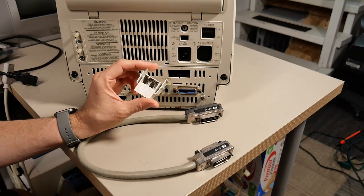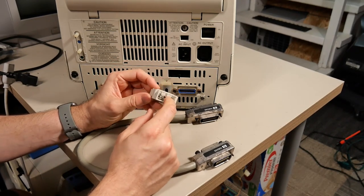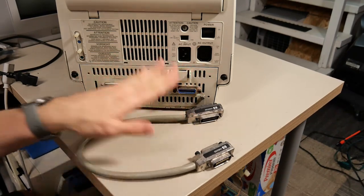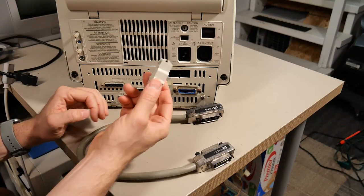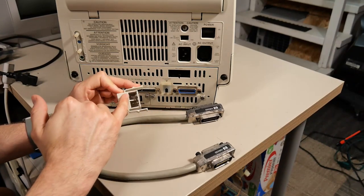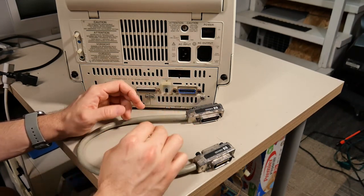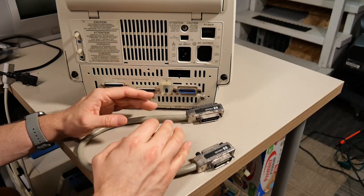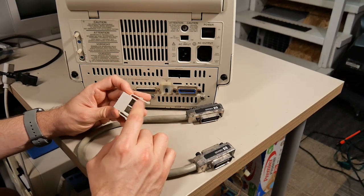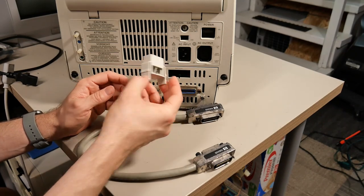This opening on the disk drive is actually for the CMOS battery holder — it takes two 1.5-volt stubby batteries. You put them in, slide it in and clip it, and that gives three volts for the CMOS. The reason this is out is because they had leaked, causing corrosion. They weren't in this machine when I found it, but they had caused corrosion. Inside there are battery contacts on the main motherboard — one of them is all green and corroded. I need to sort that out — I'm going to probably install a CR2032 or something.